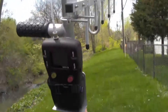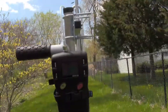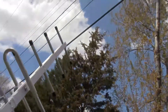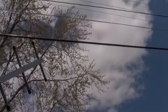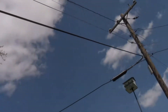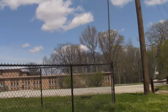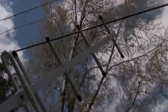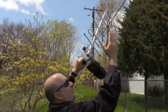The level is rising — it goes up to 100 microvolts, and I'm basically halfway between poles. I'm going to take the time to sweep across and see what my levels do. As you can see, it just dropped off to nothing when I'm pointing right at that drop over there, with nothing coming from that direction. If I swing it back, at this point I'm sweeping the whole cable.